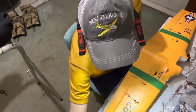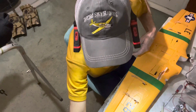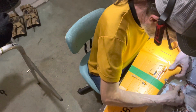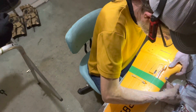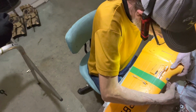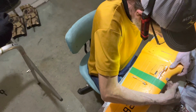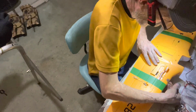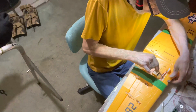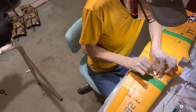I'm not going to have a plug on the end of it, so I don't really have to make the hole too big. But you've got to have enough room for the shrink wrap that's on the bulb. You gotta remember that you got to have enough room for that shrink wrap to go in there. You don't want your shrink wrap all forced in there and folding over and everything, because you're liable to break it and ruin your LED bulb. I don't want my drill bit dragging up against my LED leads or my servo leads.